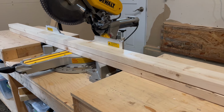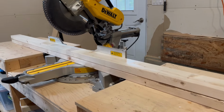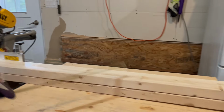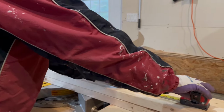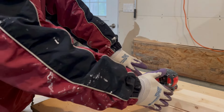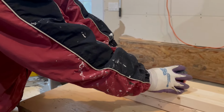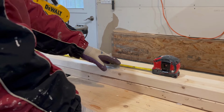So for 20 chicks, we are making a brooder box that will be 3 feet by 6 feet. So we'll make a base of 3 feet by 6 feet. Now, these are 2x4x8, so I have taken two pieces. I will cut them into 69 inches, because this will be the long side, and the short side I'll put over it. The short side will be 1.5 inches each side, so 3 inches. So 69 plus 3 inches will be 72 inches, which is 6 feet. So that is the plan.